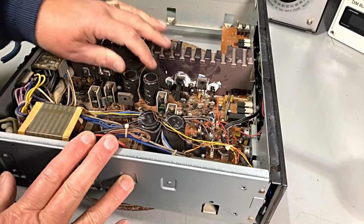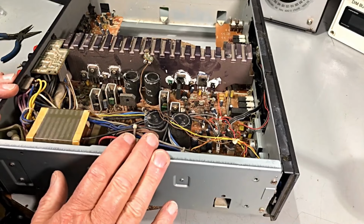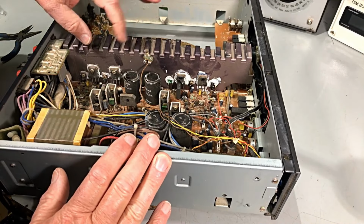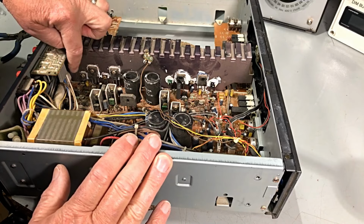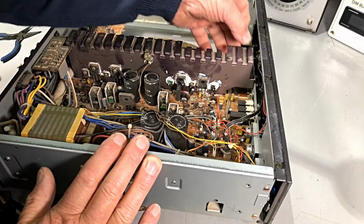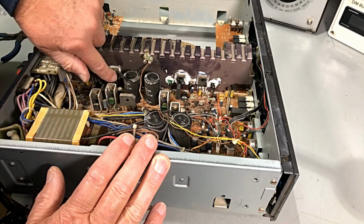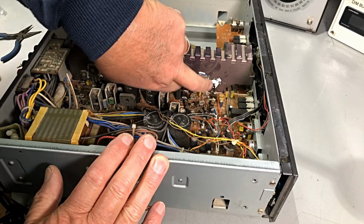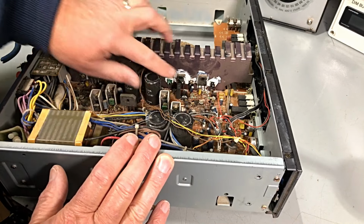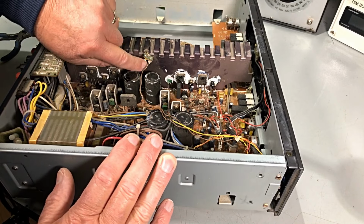All right, we'll get underneath and start desoldering these fellas. A change of tactic here. Going to leave these fellas here, and I'm unsoldering all these. There are half a dozen screws here to take the heatsink and the transistors out. And we will need to get to the screws there when we get the new ones, to put them back in. So I will take him out.